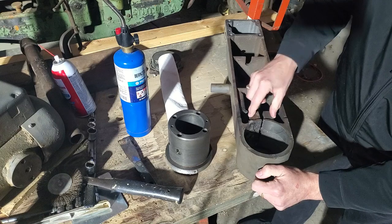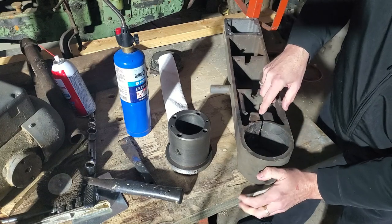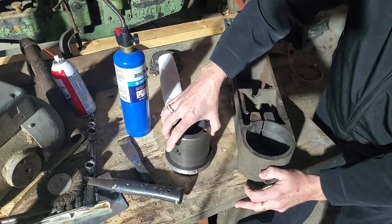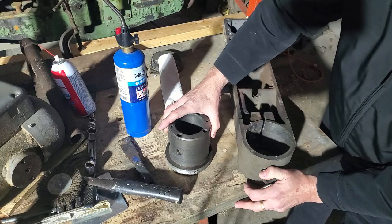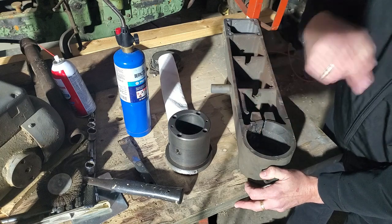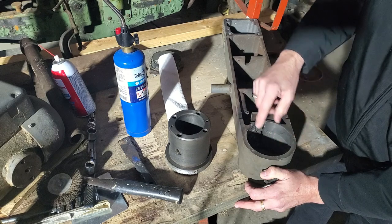And when I clamp this up, I'm going to wedge something in here and on the back side so I can get these tightened somewhat. And then this is a 4 1/4 inch diameter piece. I'll get the mics on that, 4 to 5 inch mics, and get an exact diameter and try to determine what this was before all the work and all the distortion.